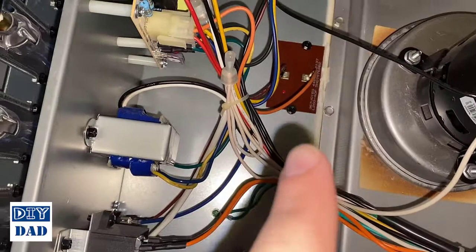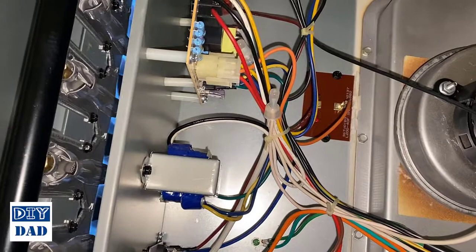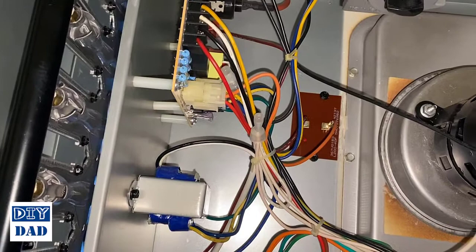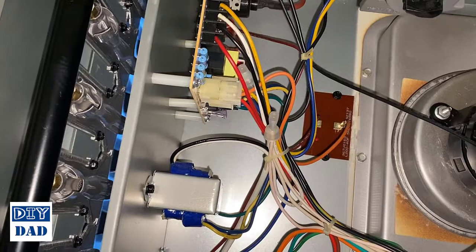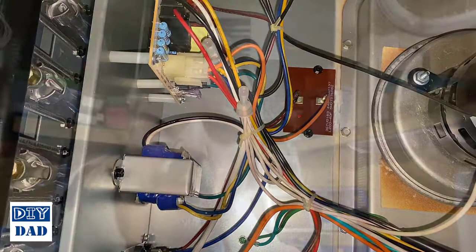This is a four dollar part if you can find it. Looking for mine two weeks ago, I found a lot of places back-ordered and one place that had one for about 45 dollars — I paid the extra amount and right now I'm glad I did. I'd suggest that if you have a garage heater like this, it wouldn't be a bad idea to get a high limit switch or high limit sensor and just have it in your bag of tricks, because from everything I'm reading online that is the thing that fails most often, and it's a super easy repair.